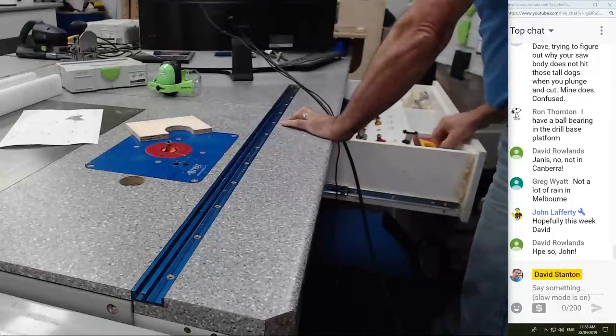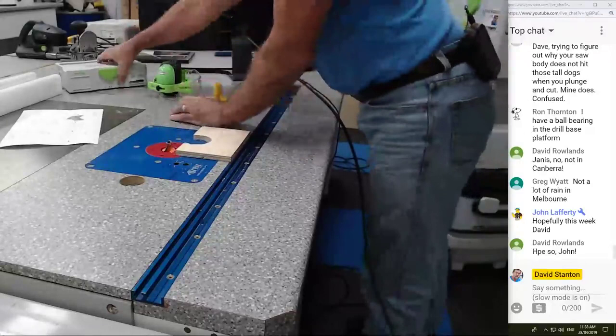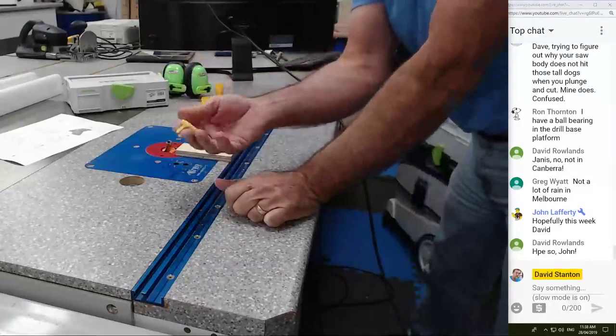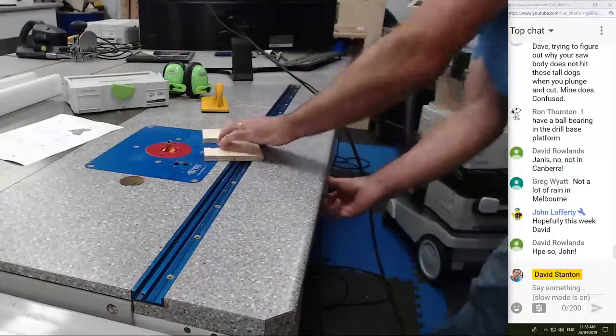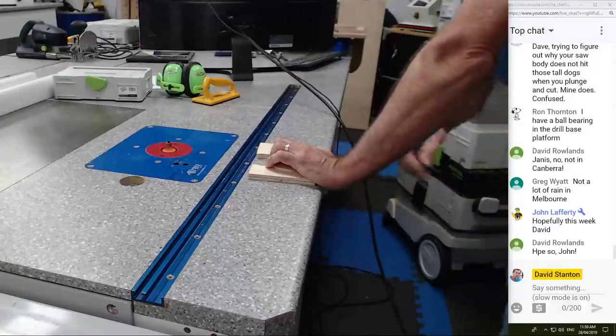And what do I want here? I want one of these, just a push block. I've got the gripper there as well, which does a fantastic job. I'm this way up, remember. And because I have grandchildren that visit me in here, this is a lock that goes into the switch. This is a manual disabler. If this is not in the switch on the outside of the cupboard here, well then I can't turn the router on. So there we go, it's in now. I'll move things away because the router cutter creates draft. So let's turn her on. There we go, we know it works.